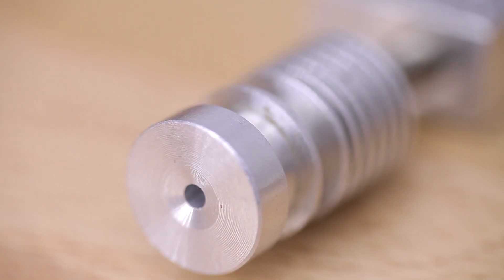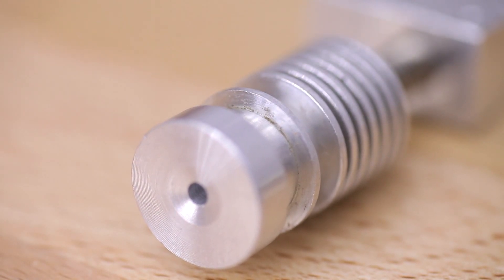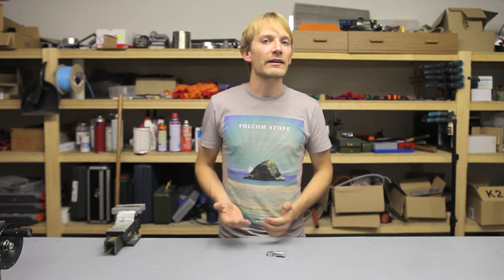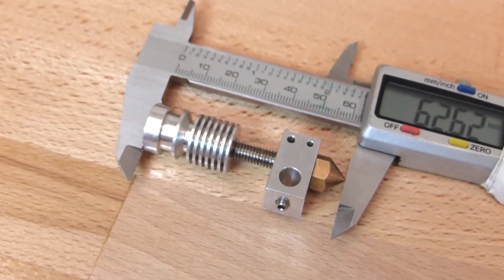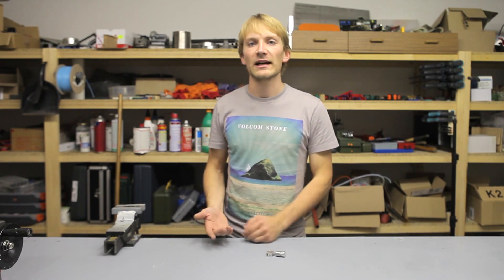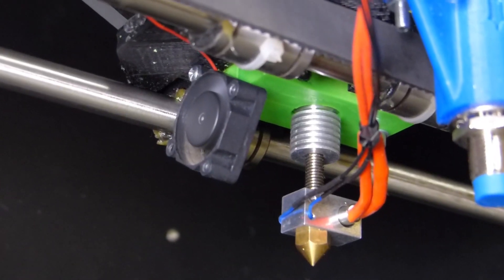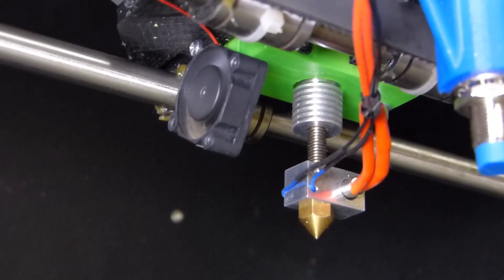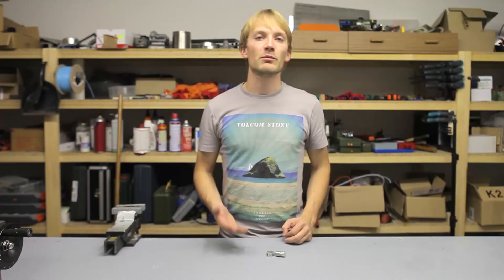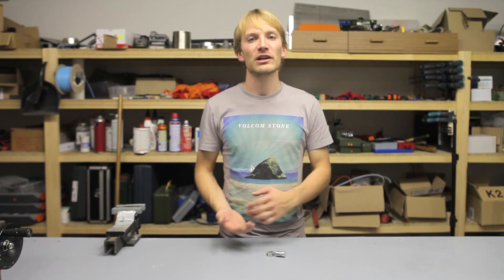For mounting it to a printer, it uses the industry-standard 16mm groove mount, which fits practically every printer out there. Size and length aren't going to be an issue since it has a very normal length of 62.62mm and isn't particularly bulky in other spots. However, you should plan ahead where you're going to mount the fan, because for me that was the biggest annoyance when mounting it. I ended up drilling a hole in my hotend adapter and screwed the fan in right there. If you're planning on mounting the Alu Hotend directly in your extruder, make sure there is some space for the fan's airflow to actually reach the cooling fins.